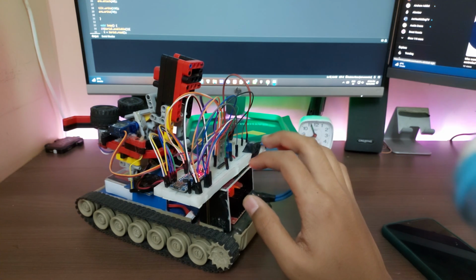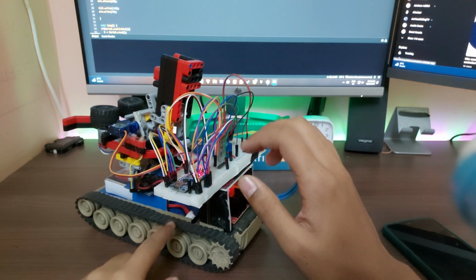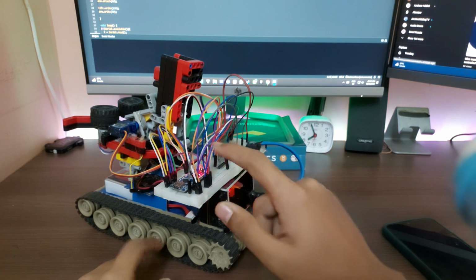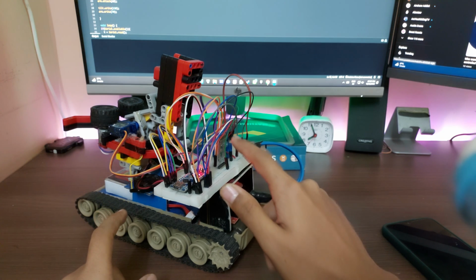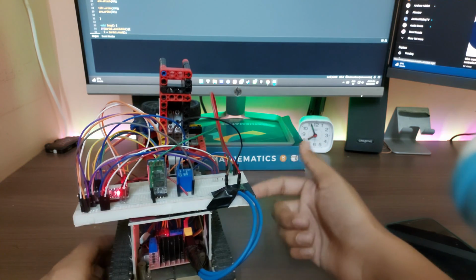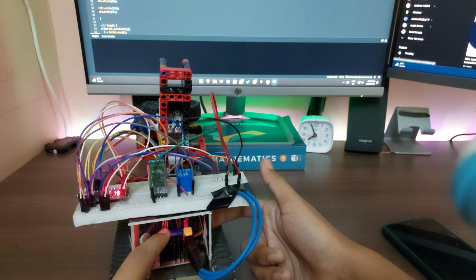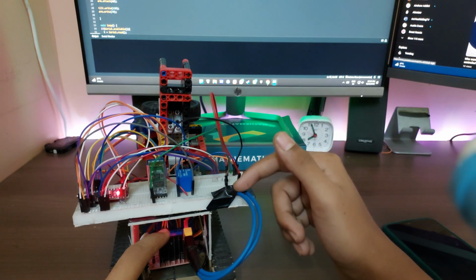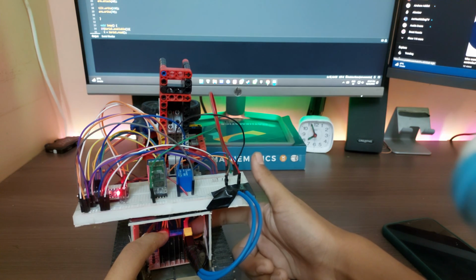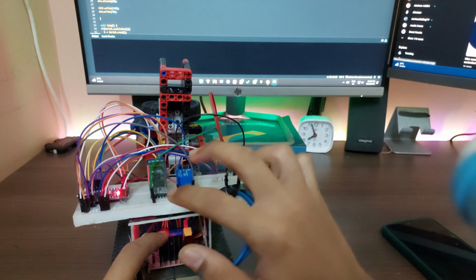Anyways, I'm taking way too much time here to explain this, so quickly, the Arduino Nano is connected to this guy. This Arduino Nano is the brains of the operation. It's also connected to both the servos which are controlling that, and the HC-05 is the Bluetooth module, as you can see here. For voltage step down, we are just using the regular built-in voltage step down for the L7805. The 12 volt goes in. As you can see here, this is the main 12 volt line coming in from the battery. This guy is plugging into this rail, which has the 12 volt ground and power going into the L7805, as well as the ground and power going into these relays.